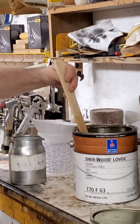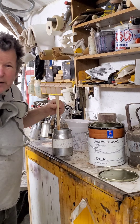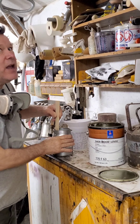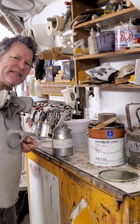Either spraying or not. And on a side note, if you're spraying and you leave your finish in the jar for a night — which I do, it's lacquer, it's okay to do — you still want to stir that up, dump it out, and refill it. There you go, more fillers in the bottom of that. Hope that helps, see you next time.